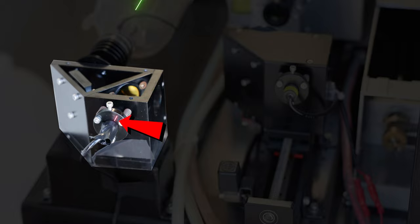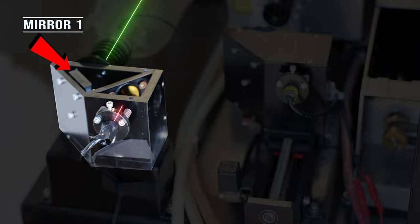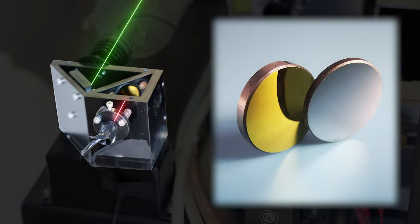The other option is the use of a beam combiner. What it does is send the visible red laser beam down the same path as the CO2 beam. The way it works is the laser tube produces a 10,600 nanometer beam; as it exits the tube, it's sent to mirror one, which is located inside of the beam combiner. The first mirror is an opaque surface with a special coating, and the beam is 100% reflected at 45 degrees and sent down its path towards mirror two.